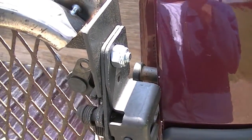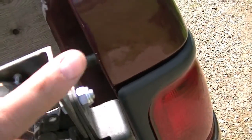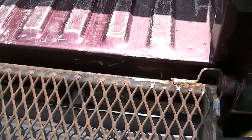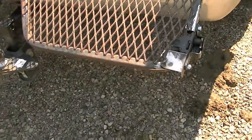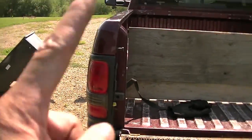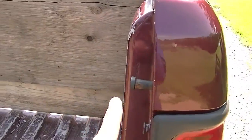So what I'm going to have to do is cut these spot welds off and bend this in a little bit so I get some clearance. Take two of latching it. I moved both of them in a bit on both sides. The box kind of curves out a little bit so the clearance issue is actually up near the top of the pin, not down here. That's why I'm hoping curving this thing will do the trick.